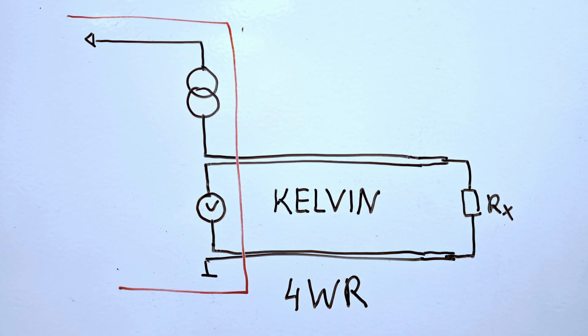We're going to measure a 0.1 ohm shunt resistor using the Uni-T meter in two-wire mode. Even though Uni-T provides very short test leads to minimize error, their resistance still adds up to 50 milliohms, so the meter reads 150 milliohms instead of 100 — a 50% error. In contrast, in four-wire mode, the voltage isn't measured at the meter's terminals, but rather at the resistor's own terminals using two additional sensing wires. This eliminates the effect of voltage drops caused by the test current in the leads.